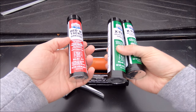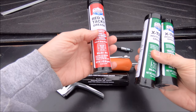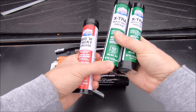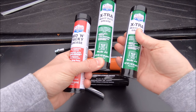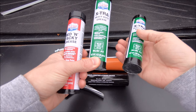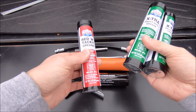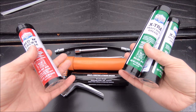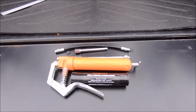I also found these nice mini grease cartridges to go with it — I think everything here was about 25 bucks, so very affordable. This NLGI number two is the specific one I use on my drive shaft, and these are also NLGI number two but extra heavy duty grease — specifically for heavy truck, farm equipment, and construction equipment. They came with it; I'll probably just buy this one in the future. But like I said, if you're not greasing stuff all the time, save yourself a little money and grab yourself a mini grease gun.